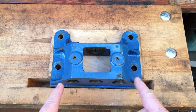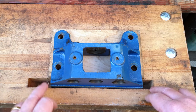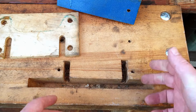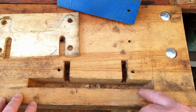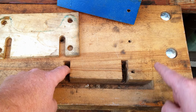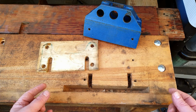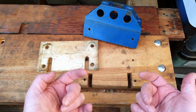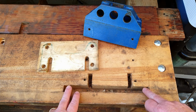So what I need to do is basically recut this on the underneath. This is quite easy on this side because I can just use the existing hole as a guide for the new one. Now I could just chisel straight through, I could just chop straight out the bottom, but that will probably splinter the bottom out even more than it already is. So what I'm going to do is bore some holes, one here and one here, and then probably one there and one there. And then on the underneath, I can mark between those, scribe a line between the holes and then chisel from the other side through to connect with this. When that's done and I flip things back over, then I'll just fill these up with some bits of wood